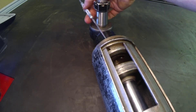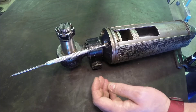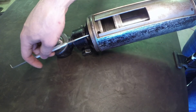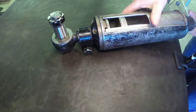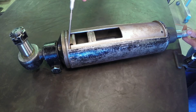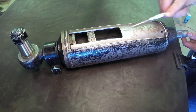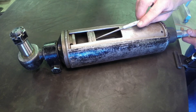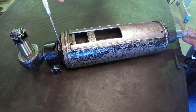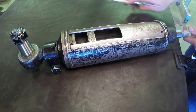The other work port comes through a small hole — you can see the seal passing through that hole — so the retraction side sends its oil through this port, through the small hole, around the sleeve, all the way down, then in through this hole to act on the annular surface area. Oil is sent in to extend and push the piston out, or sent around the outer sleeve to act on the annular surface area and retract it.